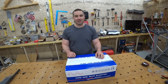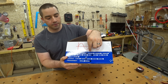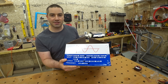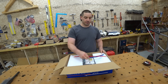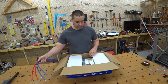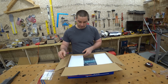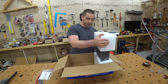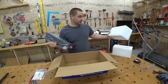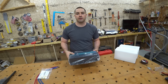If you have any questions, leave them in the comments below. Specs on the side of the box: it is a 3000 watt inverter, 48 volt battery, 120 volt output, and 60 hertz. Inside the box it comes with some positive and negative leads — I don't know what gauge these are — some fuses, a manual, and the inverter itself. It came well packaged inside a larger box. I bought this on eBay for $295.